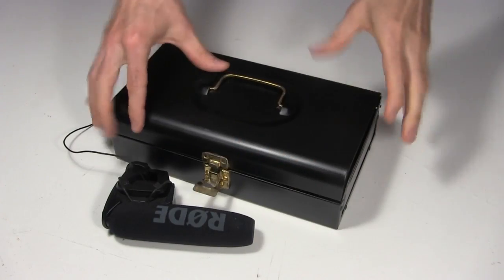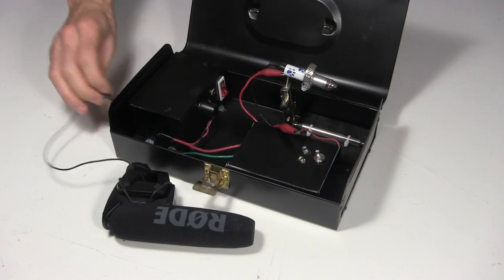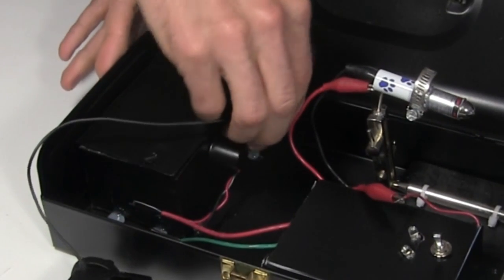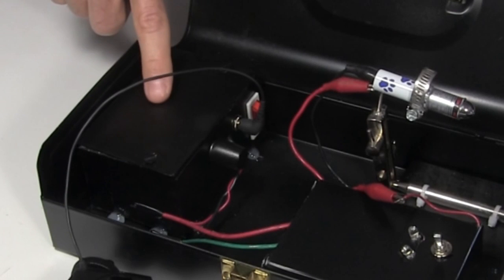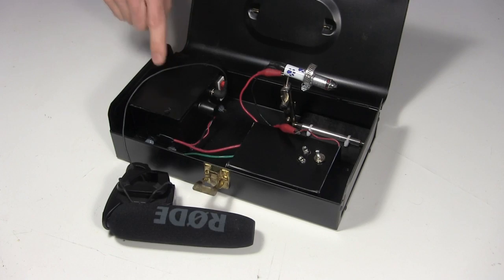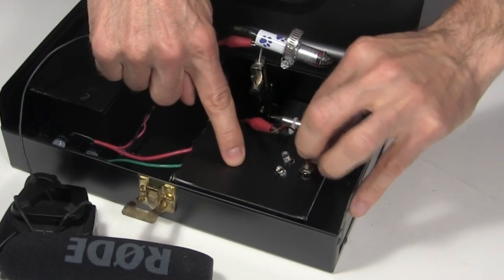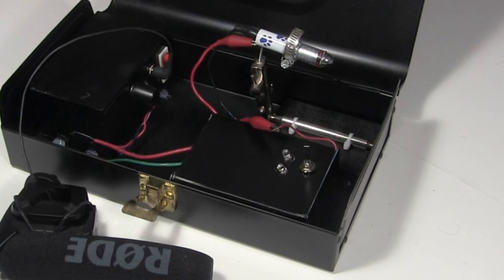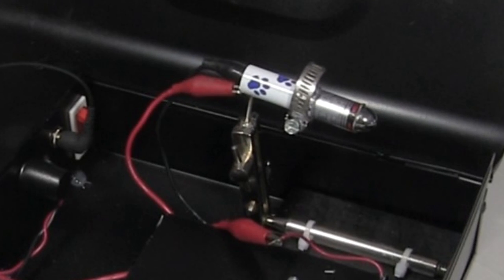Here's a closer look. I plug the microphone in here. And here's a homemade amplifier — it amplifies the sound from the microphone. That then is sent into here where the batteries are for the laser. It's also in here that the amplified signal from the microphone is mixed with the power from the batteries to produce a new fluctuating power that's sent to the laser.